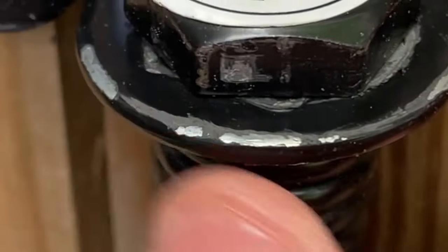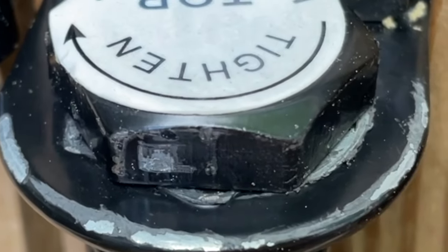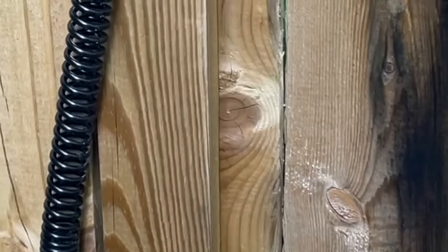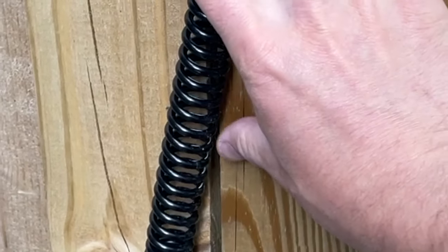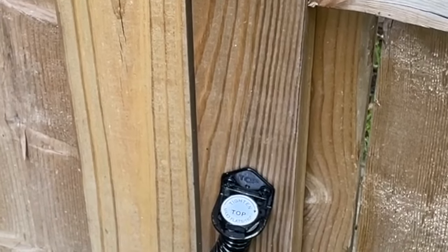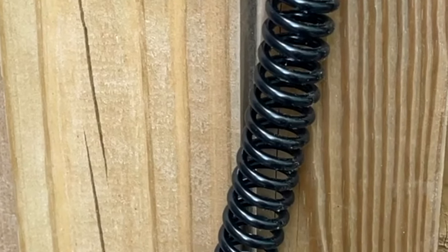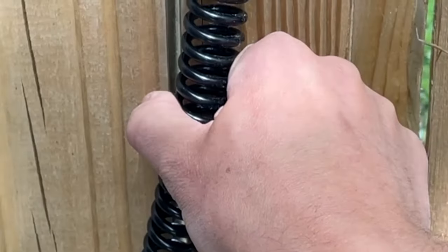Between the flat part of the hex and the back piece there's a little metal bar. You make it flat, slide the bar in, then use a crescent wrench to take the pressure off and turn it about 10 degrees so you can slide the bar in and out. Right now it's locked in place. If you want more closing power, do not over-tighten the spring — instead, buy a larger spring.